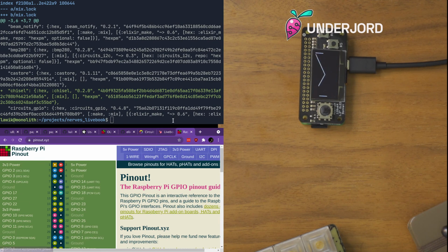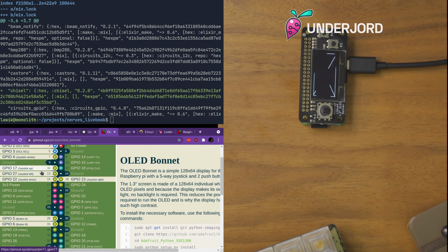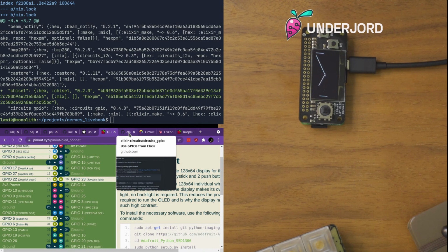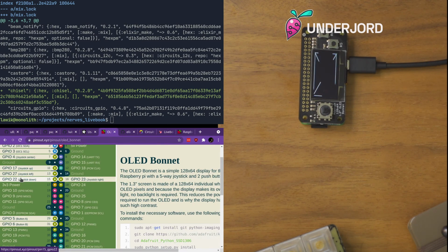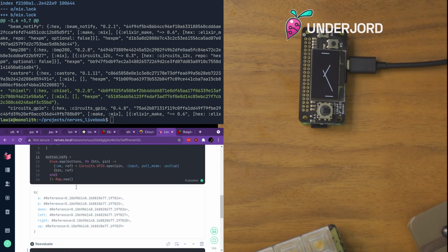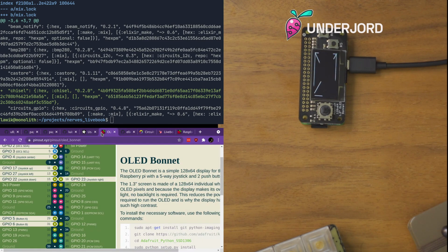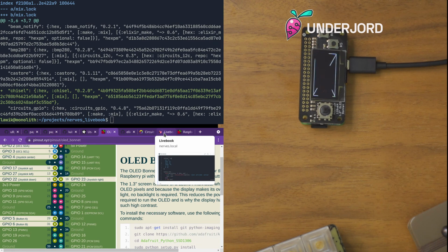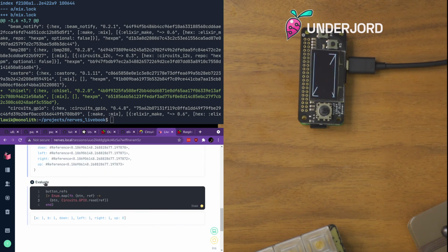Yeah, so as you can see, I might have done that wrong. It's like GPIO 17. That's pin 11. All right, so let's try to fix that. Oh, I need these next to each other. Okay, 17, 27, 22. 17, 27. Ha! And that one I accidentally grabbed from the right number. 4. 23, 29, 31. 23. No, wait. 23, 5, and 6. Yeah, 23, 5, 6. So that would explain why the button might not have reacted the way expected.